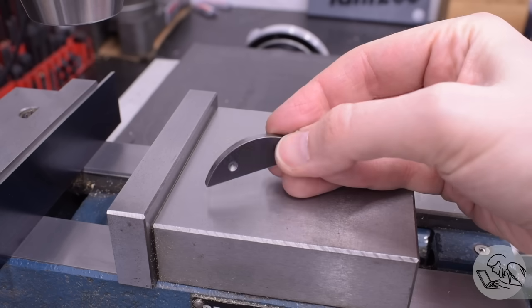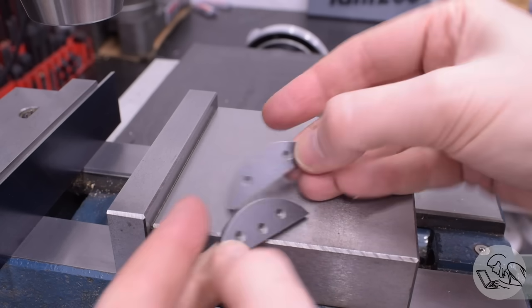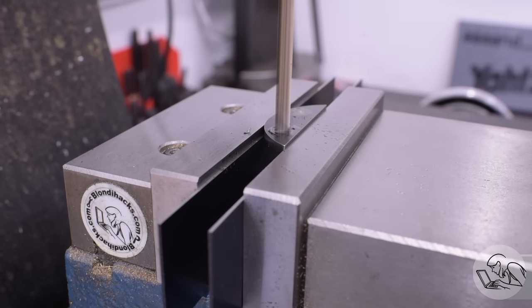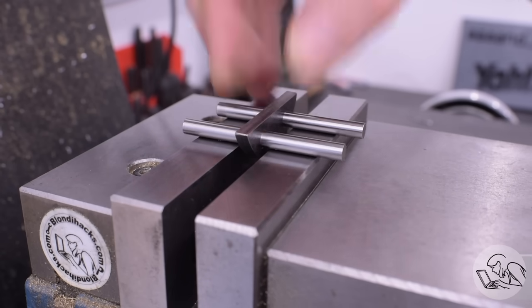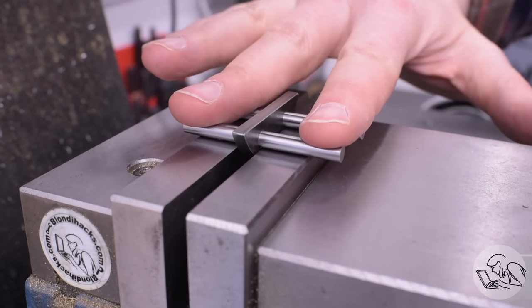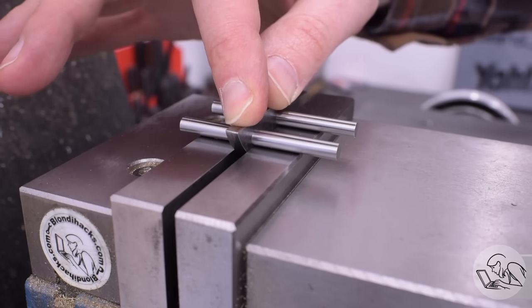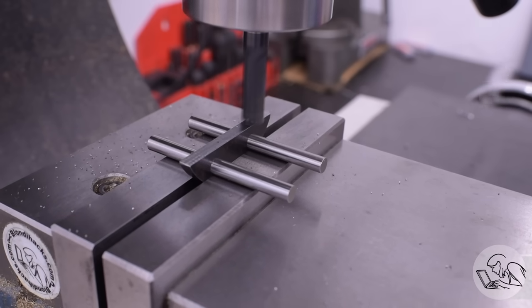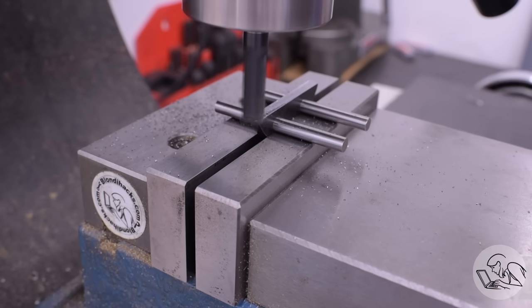Next up are these little half-moon pieces. There are two of them and they form a set of ways on the top of the work head where there's a sliding collet block — the kind of thing that runs between them. So once again we drill these out according to the pre-drilled marks. Those holes are the references for machining the top edge, so I've got it set up with some gauge pins through the holes, lined up on the top surface of the vise. Now I'm going to do a light cleanup cut on this just to get rid of the laser candy, and then I can start taking measurements from here.